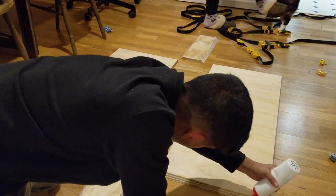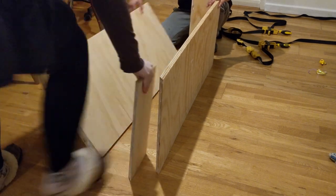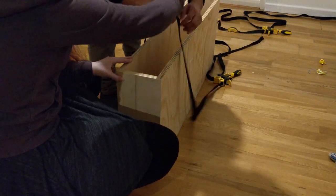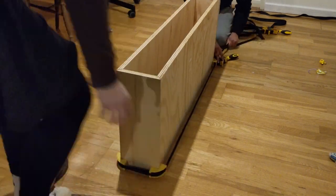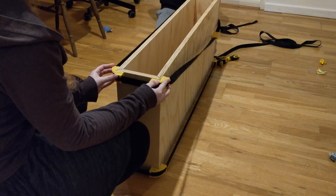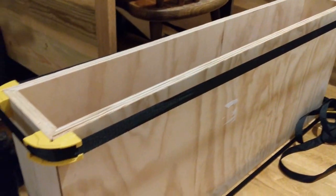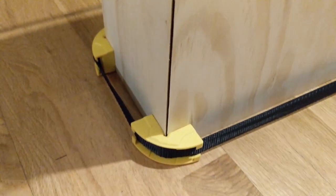I've done this type of thing before on previous projects, which I've also made videos of on my channel. However, this time it didn't go well. I was certain the saw blade was set to 45 degrees, but something clearly went wrong and I didn't even check that the angle was cut correctly afterwards, so I only came to notice the issue during the glue-up, which was frustrating. I didn't want to disassemble the glue-up and re-cut the miters as there wasn't enough wood to cut down without ending up with drawers that would be too large. In hindsight I should have made the drawers fit the table, not the other way around.